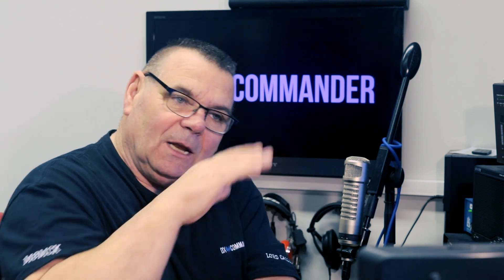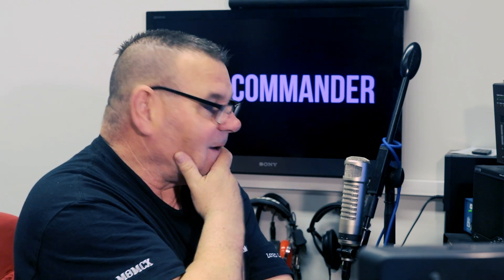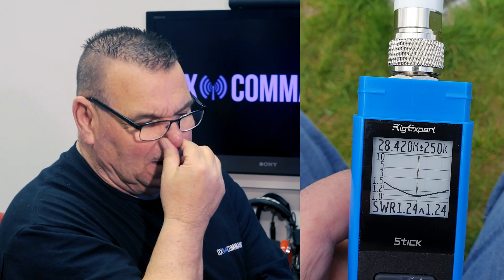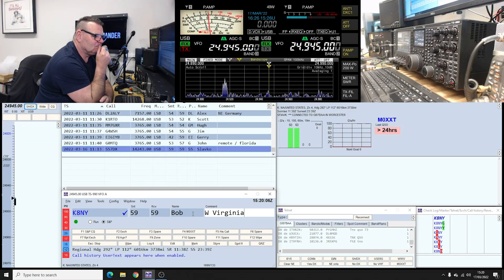For DX though, we actually want a bit of an angle — five, six, seven, eight degrees take-off — and that's what this is giving us. On 10 meters we've got quite a big bandwidth, bigger than any other antenna we've developed, because it's the three-quarter wave, and also right at the top end near 29 MHz we've got another harmonic starting to kick in on this 80 meter thing. How well does it work? Well, unbelievable — on 12 meters I had a fantastic copy the other day, five-nine-plus with a guy in the US.